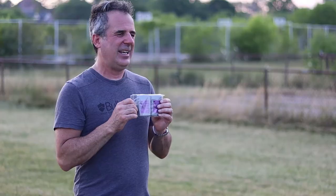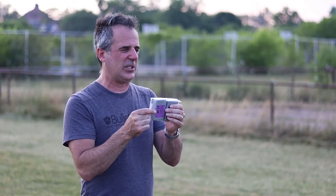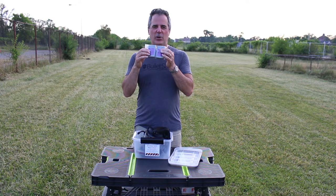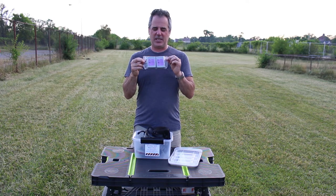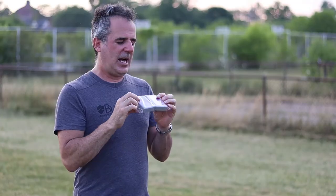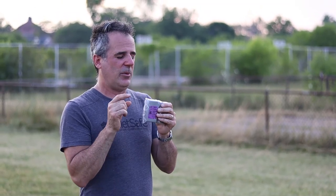The other filter included is a genuine 3M brand P100 filter. This is good against those particles that carry viruses and bacteria. So if you're working in a morgue or an emergency room or something like that, you're trusting your life to this filter — so you want a good seal and a great filter. This one will last as long as you can breathe easily through it. When you find that your breathing is restricted, you're going to need to replace it.